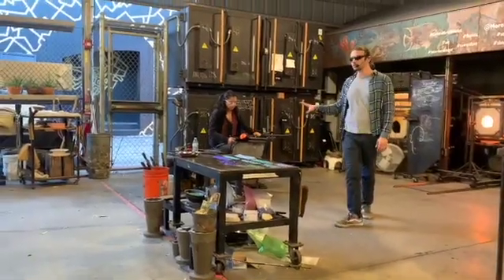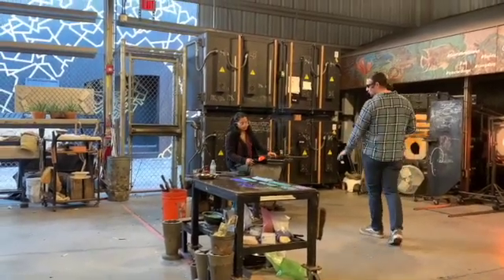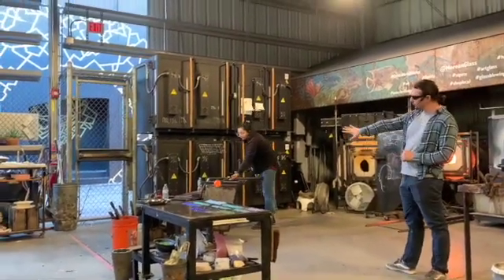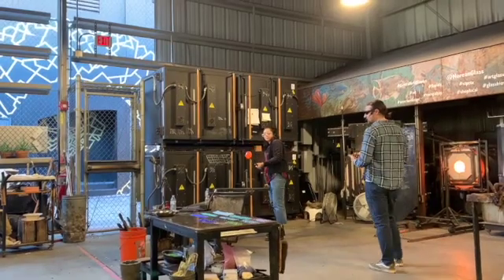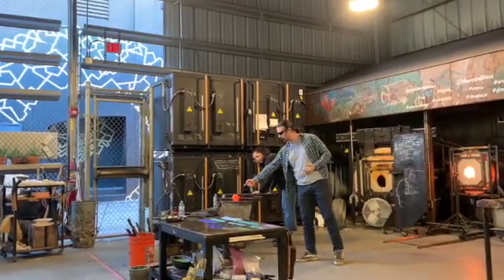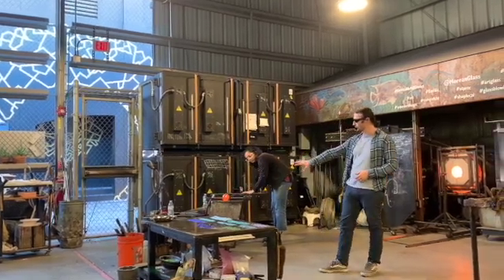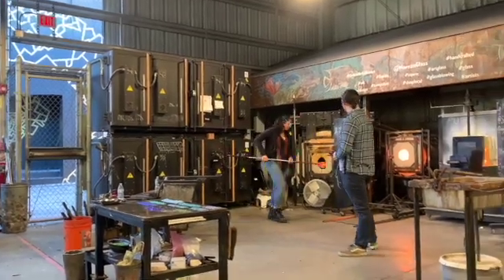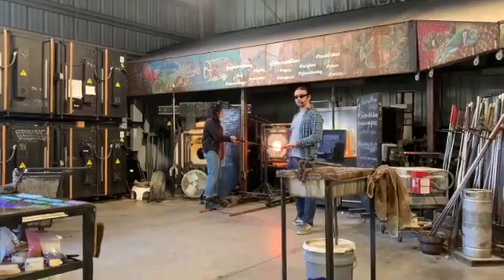Until now she hasn't blown into the glass at all. Now to create a bubble there, first she wants to make sure it's in this nice even q-tip-like shape. That move right there just trapped the air in contact with the hot glass, which will heat up the air and make it expand. As the air expands, it'll push its way out of the pipe forming a bubble inside of it. You can see that bubble as it forms right now. So now just like that we've got our bubble.